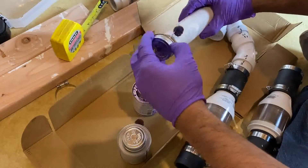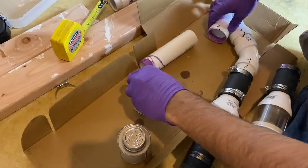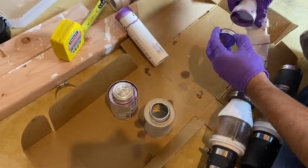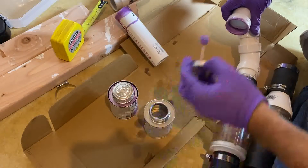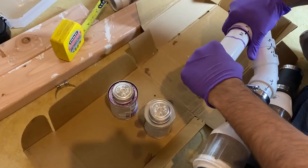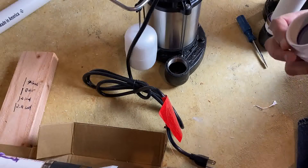Here I'm going through the rest of the pipes and connecting them using primer and glue — I'll fast-forward some of this. You may notice some primer mess on the pipe from my mistakes; I learned that this primer runs a lot, so use a little and there will be less mess. I'm also showing you the quarter turn and lining up the numbers. Next, I'm putting white Teflon tape on the threads before connecting them to the sump pump.